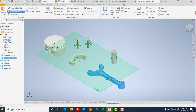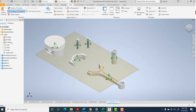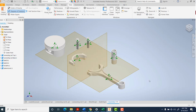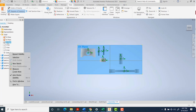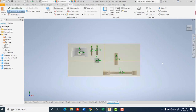I'm going to use the assembly coordinate system to give myself a floor and a wall. If you look at your view cube, there's my front. You can decide how you want everything oriented. It might be nice to have things so that when you look at the front, and this matters when you bring it into your IDW, it will bring it in with that orientation. So think through that as you're placing things.